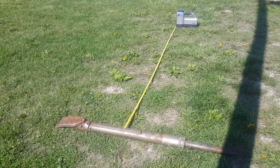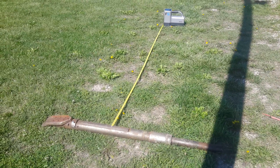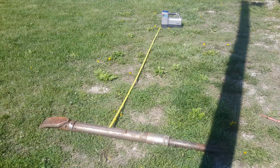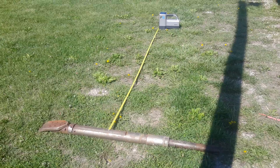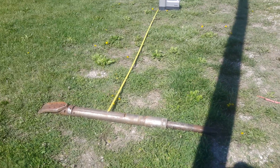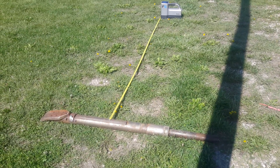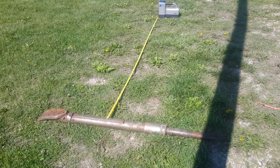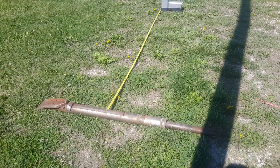Hello drillers, another video today. We're getting ready to do a calibration on our drill head — we've just replaced the batteries in our sonde. From the old Mark 3 days, we used to calibrate to the center of the box, but these new locators are supposed to calibrate to the left edge or the right edge of the box. The locator I get to work with is an F5, which is a great locator in my opinion.